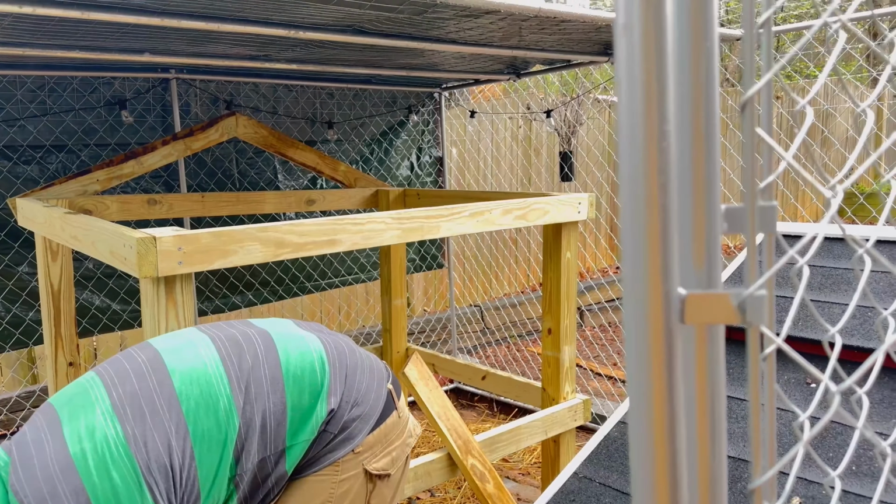Here he placed 2 more 2x4s to the base legs of the front and back side of the base. 2 more across the base. This is to have the extra support for the base plate. Now he is cutting the pressure treated plywood for the base plate.